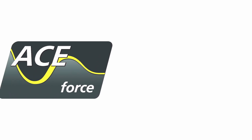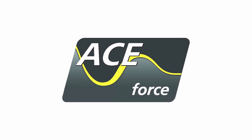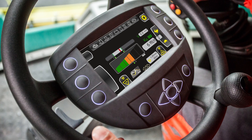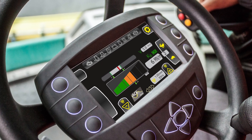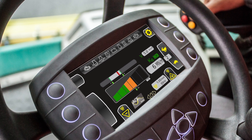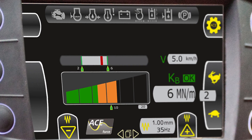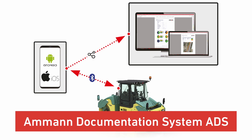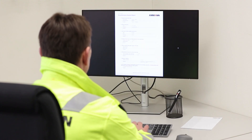The ARX line can also be equipped with the innovative intelligent compaction measuring system ACE Force, which is integrated into the central multifunctional display. The ACE Force system provides advanced functions for even easier and safer machine operation. It also provides compaction guidance, easily readable on a graphic bar on the multifunctional display for optimal production. The data can also be later analyzed by the AMMANN ADS documentation system.